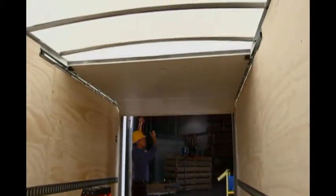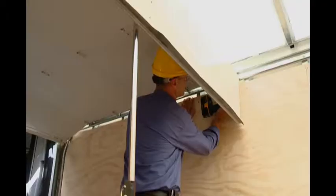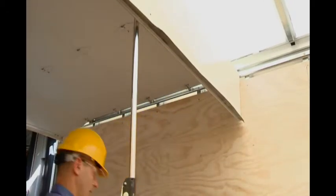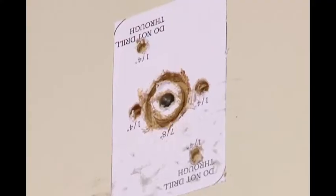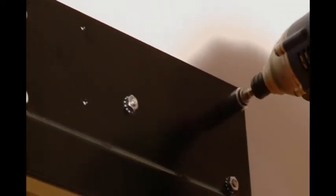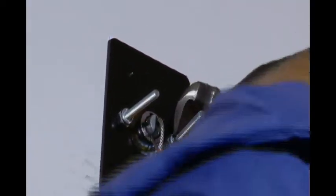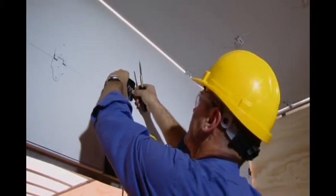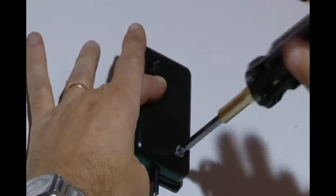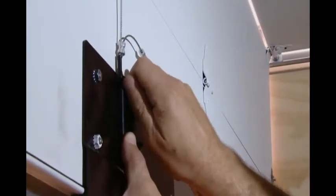Open the door fully. Loosen and remove the nuts and rollers from the top door panel. Use jack stands to support the weight of the door and remove the nuts and rollers from the second panel. Using the seven-eighth inch hole saw, finish drilling from the front side of the door for the key lock cylinder. Use the fasteners provided to install the mounting plate. Push the emergency release cable through the door panel, through the mounting plate, and through the cover plate. Fasten the key lock cylinder through the door to the mounting plate with the fasteners provided. Use bolt cutters or a hacksaw to remove any unwanted length. Fasten the cover plate to the mounting plate with the machine screws provided, then fasten the emergency release cable to the door plate on the top panel with the plastic cable clamp and two machine screws provided.